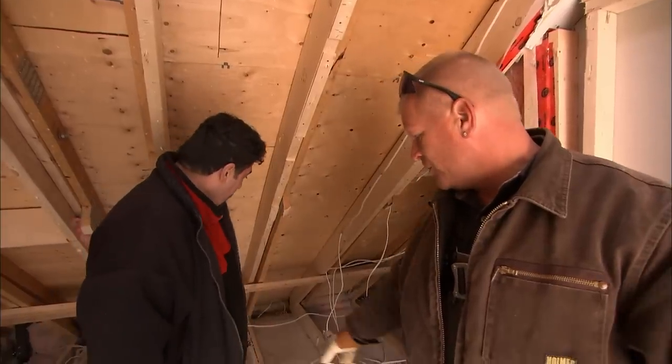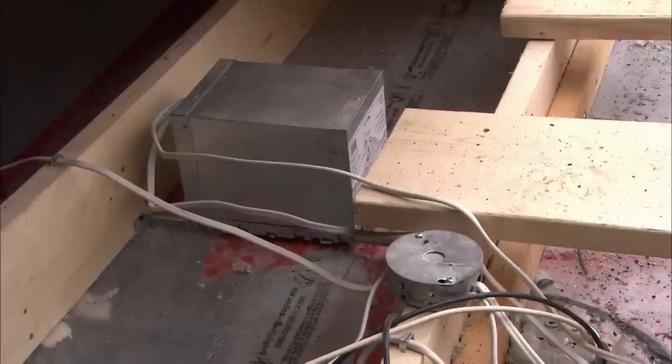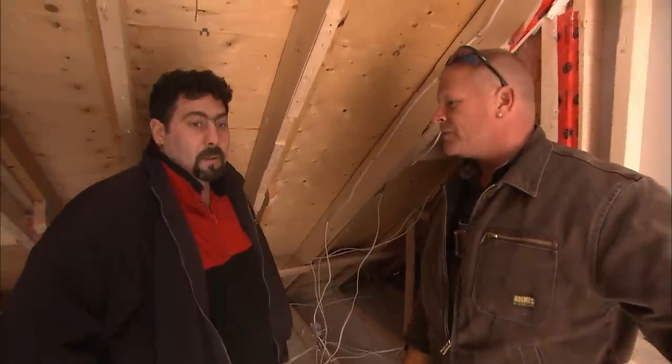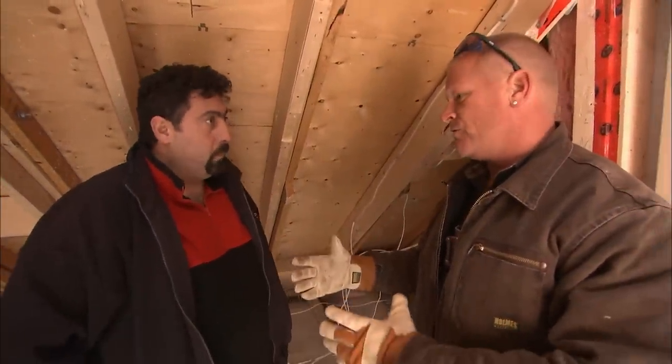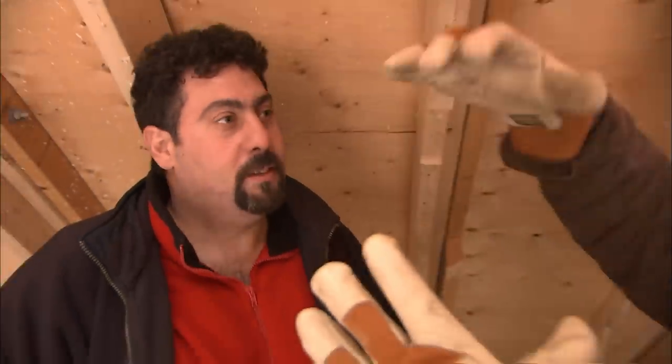You're going to love the way they did the pot lights in the ceiling down here. We had some proper pot lights with housing, and then the other pot lights — no housing. There are only two with housing, so we had all the insulation in with retrofits. It clearly says it right on the retrofit pot light that within three inches of insulation, you don't use it. It literally says it, and they piled insulation right over it. Nice little fire hazard.